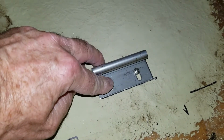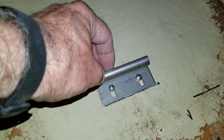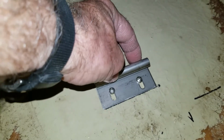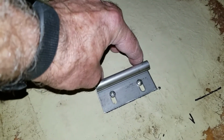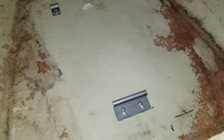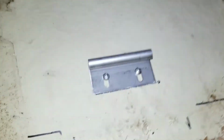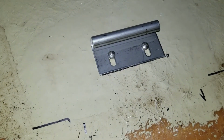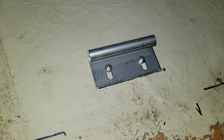I was able to lock these, and then I marked it, pulled the toilet, locked these down, and even if these screws came a slight bit loose or something, it's almost perfect because the body of the toilet won't allow them to back away from the latch. So you may want to drill it where they recommend with the template, so you end up with a bracket that looks like this in the front, where the screws are per the slots.